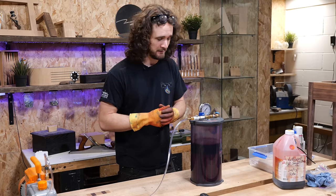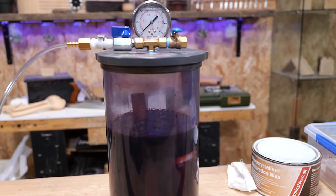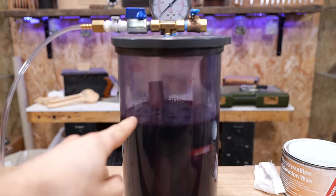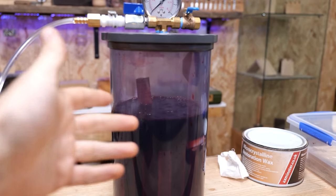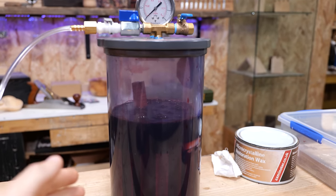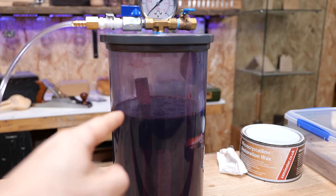Now it's just a case of leaving this for a few hours, letting the bubbles settle down. I would recommend not leaving this overnight or unsupervised — leaving a pump running unattended, even with thermal cut-off switches, makes me uncomfortable. Leave it somewhere it won't get hit or tipped, because it will implode if knocked significantly or falls off a bench, and that would be quite the mess. Occasionally with pen blanks they slip through the grate — that one poking up isn't going to stabilize correctly, so I'll take note and send it through with the next batch.